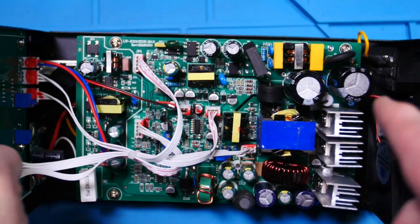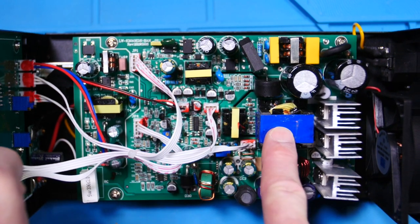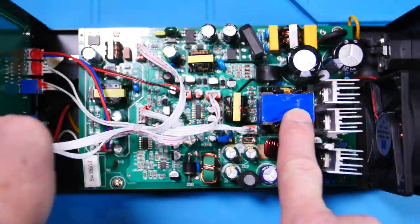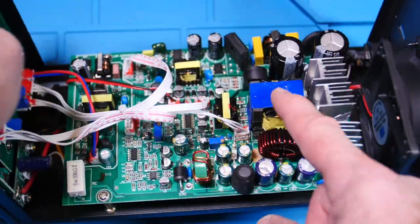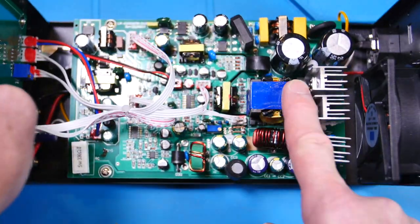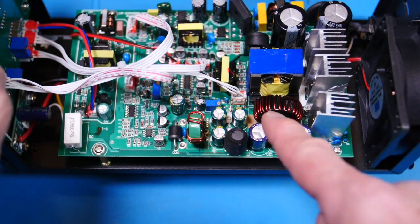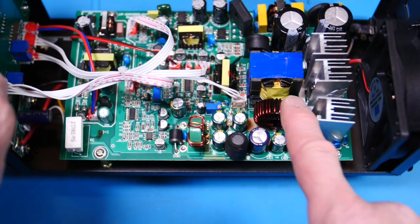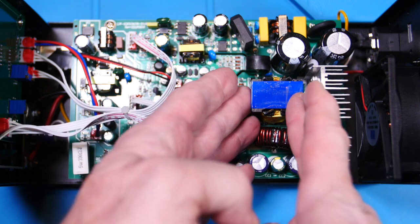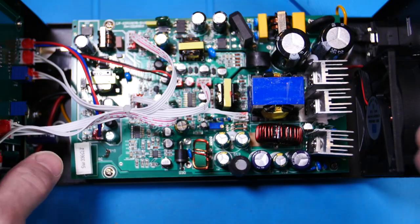Alright, so what happens is it looks like power comes in, goes through our current sense transformer over to our main transformer, switching transformer. This looks like a PQ core, which, see, it's a tall core. This is actually one of the more expensive cores, and it's optimized for winding area because it's got a long window, lots of winding, get really good coupling to the core. Plus it's fairly tight magnetically, so it's good for EMI, and it also has lots of surface area for temperature.